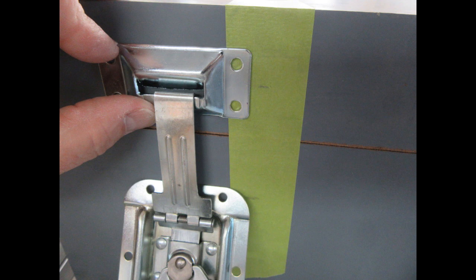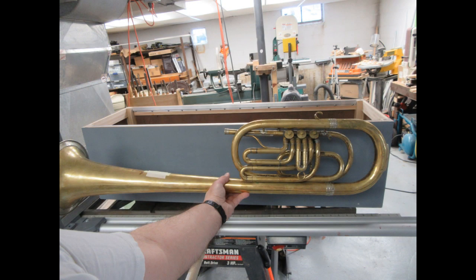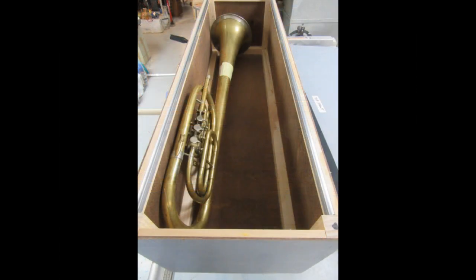I put a little bit of masking tape on the case spanning the lid and the body to figure out exactly how high I'm going to put the latch and the keeper. I want the two sets of holes on the keeper to span the frame and the reinforcing strip more or less evenly, and then have the latch itself still positioned low enough where the cutout in the masonite does not encroach on the reinforcing strip because I don't want to weaken that. The next photo shows where I eyeballed it to see how far left and right the latches should go. Here I'm doing a little demonstration to show that although the case seems really big compared to the horn it's not overly long or tall, and width-wise it has to be wide enough to clear the bell and still have a couple inches on each side.